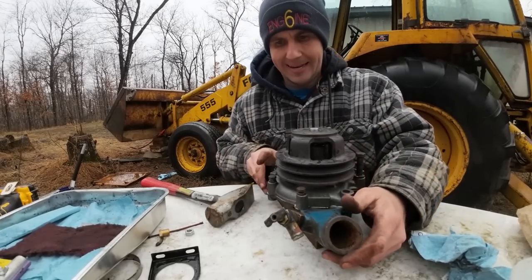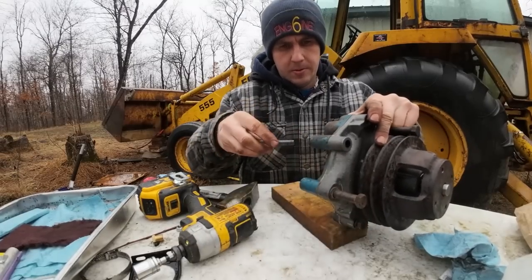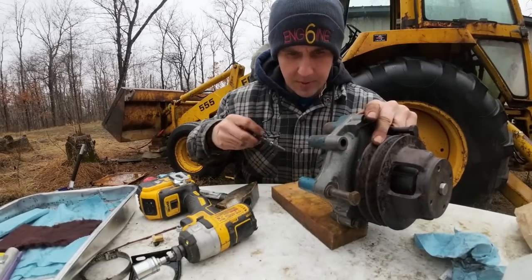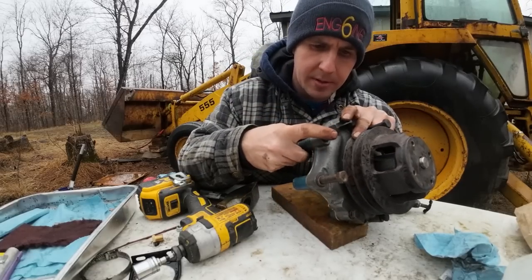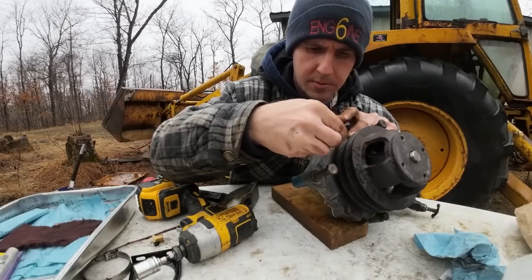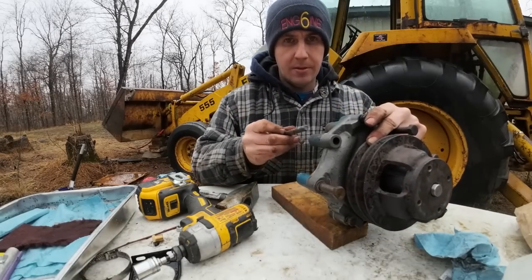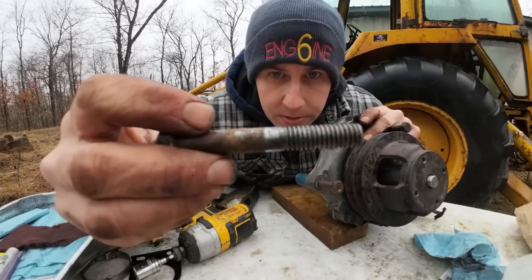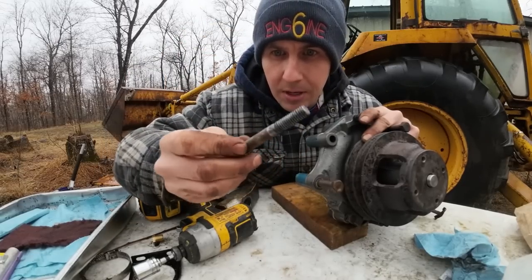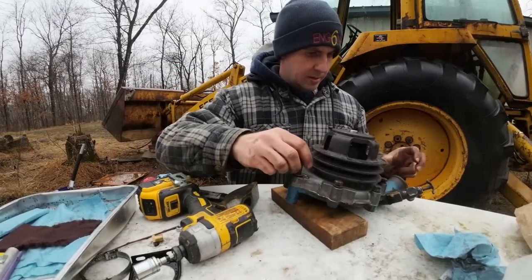I don't like that. Why does it go in like a champ from this side? I think this hole is just a touch smaller diameter-wise than the original casting. You can see on the shoulder there where it's getting the wear, which means the threads are clearing but when we're hitting we're hitting that shoulder. Maybe I just need to clean up these bolts a little bit better and then they'll go in.